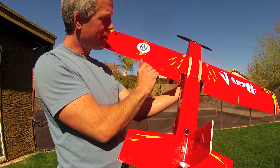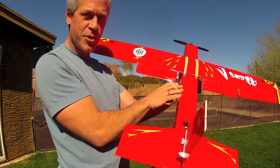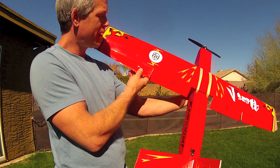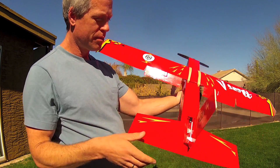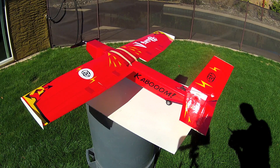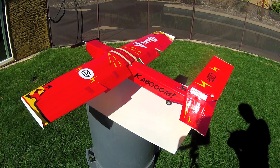It has half-length, very generous flaps, which can be lowered for short takeoff and landing and rough surface operations. Very generous ailerons as well, and of course an elevator and a rudder. Here you can see the flaps in their retracted position, about 20 degrees deployed for takeoff and cargo carrying, and about 40 degrees for stol operations.